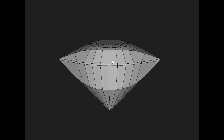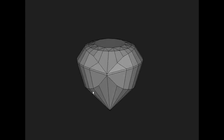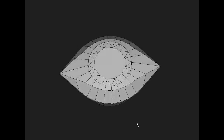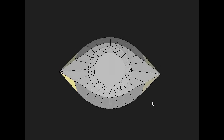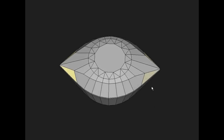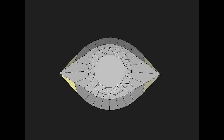So before I even started the project, I inputted all the angles and indexes from the original Bob Keller design into GemCut Studio, and I found a few anomalies with meet points not meeting correctly. Now these C1 facets that I'm highlighting were out by 4 degrees. Of course, I had to spend a little bit of time trying to adjust these angles, but these angles being out by so much affect these C2 facets next to them and all the surrounding facets. So that would also determine the height of the crown and how large the table of the crown will be.